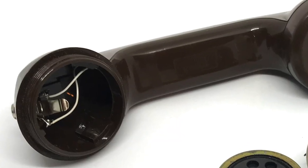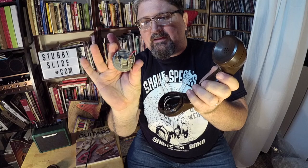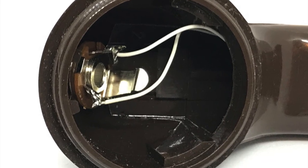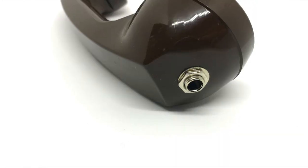I pulled this out, and there were two wires in here — two white wires that were connected to this. I cut those white wires. I took this; I don't need that anymore. These two white wires go to the earpiece. This microphone actually uses the earpiece as the mic, not the old microphone from the phone. It uses the earpiece. The earpiece turns into a mic so easily. All I did was I took these two wires and soldered them right to a guitar jack — a usual standard quarter-inch guitar jack.